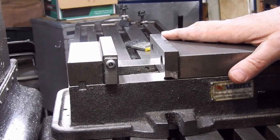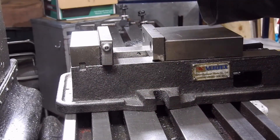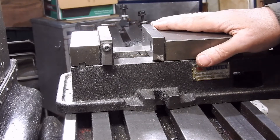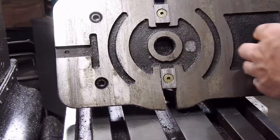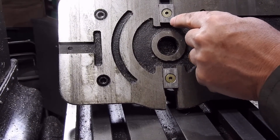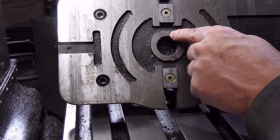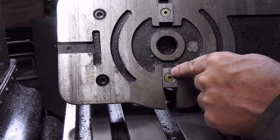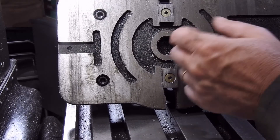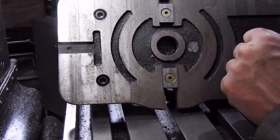Why would you use them? Some people don't. The reason is that it makes putting the piece of equipment on the mill bed quicker. The majority of times — nine times out of ten — I don't need to worry terribly much about alignment, so I have keys on there because I can just put the vise on and maybe do a couple of small checks. I don't have to worry too much about trying to tram it up. Here I've got two punch marks, and there I've got two punch marks. Occasionally you'll want to take the keys off, so it's a good idea to have them marked so you know which way they go in and which one goes on what side. After punching, I've run across with a file just to take the raised bits out.